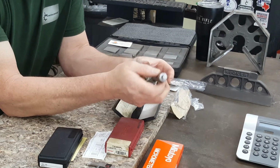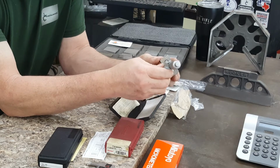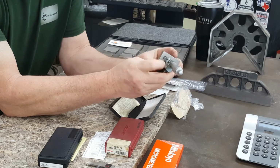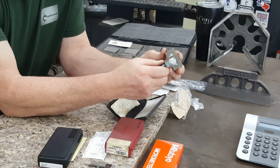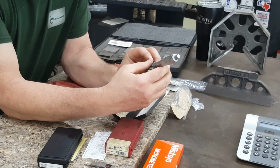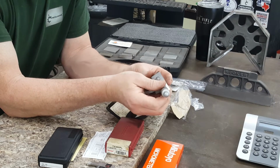if you're thinking about buying a micrometer, I'm just showing you the one I like the best. That's the Mitutoyo that I just showed. All of these are pretty good. This is Mitutoyo. This is still a good one. So you can lock this one down right there. See, that one feels a little snug to me, so it's plenty tight. So I'm measuring real close to the same thing on that one too. Let's see. Yep, it's right at 7/10 over 500 thousandths.